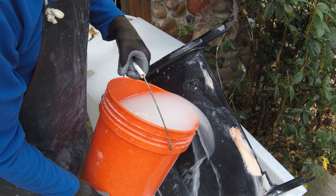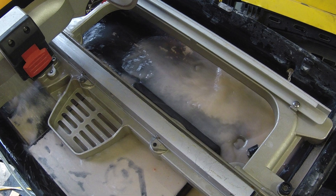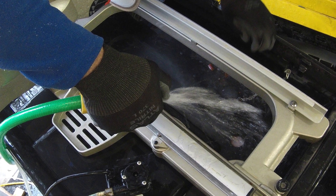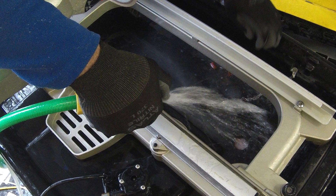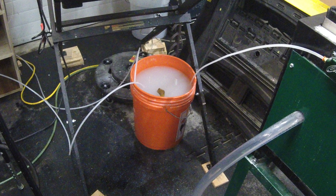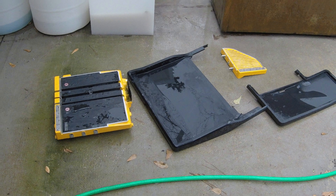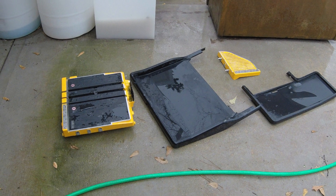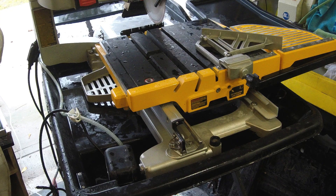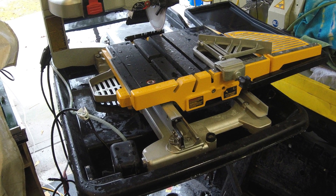When I clean things, I wash it over this base as well. As you start washing this out with a hose, you'll see that this glass dust all rinses clean. So rather than removing the whole saw, which with a bad back I can't do, I just empty these buckets that are under my saw. All the different parts that I've taken off the saw are now clean, and the residual water I used is sitting in this basin that I let settle for a few days, then I'll dump it.